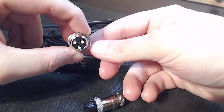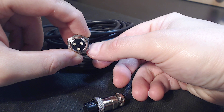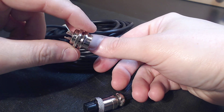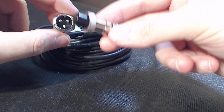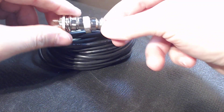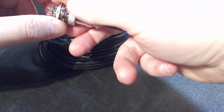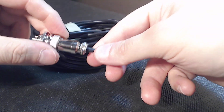I've done at least 300 of these connectors and I've never had one fail or give me any issues. Most guys once they use them never want to go back to others — they're simple to mount and these are professional solutions, which is why they're used in the aviation industry. Once you align your tabs, take your screw lock connector, go backwards on it to make sure your threads are good, then just go in. You don't have to tighten these too tight — once they go in finger tight, you're good.